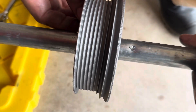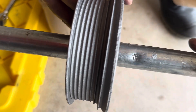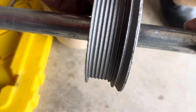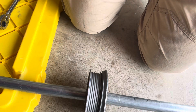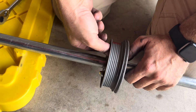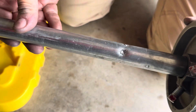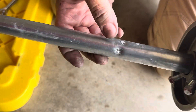So at eight quarter turns you're going to have a pretty fantastic hold, but it's messing up the tube. Let me see what happens if I put two set screws at that eight. Okay, so at eight is when you're starting to get some bad warping on the tube.